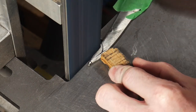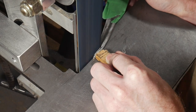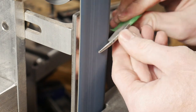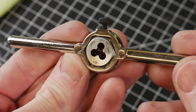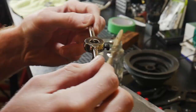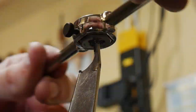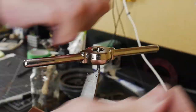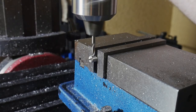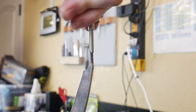With the finial done we move on to cutting the threads into the tang of the knife. I used my original diagram to rough in with a sharpie where I'd like my angles to land, then ground the tang so it was cylindrical and matched the desired dimensions for tapping 6-32 threads. I took great care to get the knife clamped in the vise and the die square to the tang when starting these threads. It actually turned out pretty darn good — the threads were nice and straight, though a little tight with the finial when trying to use the screwdriver slot. It's for this reason I went back and drilled a perpendicular hole through the end of the finial to use a drill bit to tighten it onto the tang, and this method worked great.